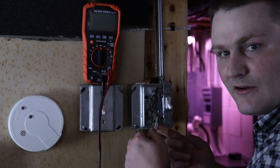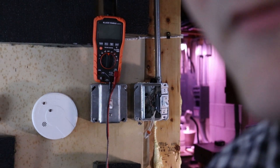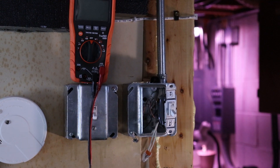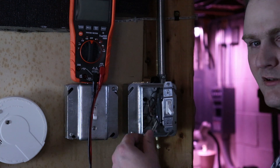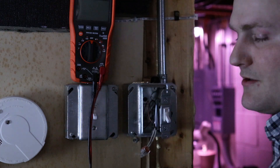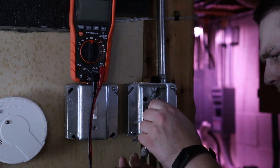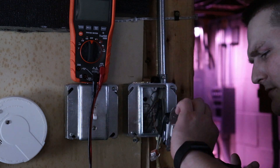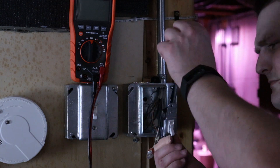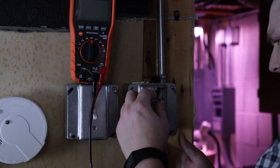So this is what it looks like inside this outlet — let me get you zoomed in here. You've got a wire nut with your neutrals, and this is how code does it. And then your switch. So we've got to figure out which side's the power side. I'm going to save this tape because I use Super 33 and that stuff's not cheap.